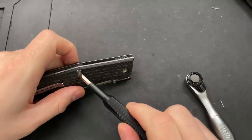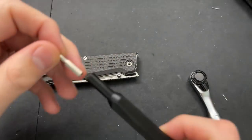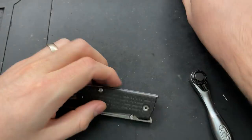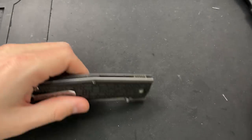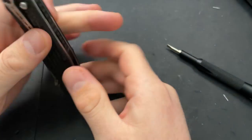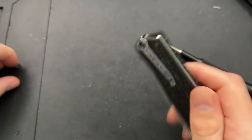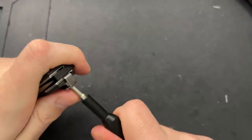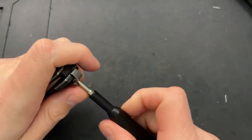Let's jump back to these screws down here. Maybe a little too wide — let's swap to a different bit. All we need is a bit of variation. Pop that out. That's a long screw. Do I love flathead use? No, I'm going to be real with you. Flatheads are used in watches and such — they clearly work and do have some advantages. It's easier to clean up a stripped screw head, and you can repair your drivers more easily than with a Torx because it's just a blade — you can regrind it. Nonetheless, it's a choice they made.